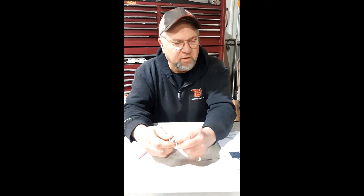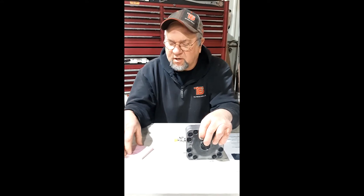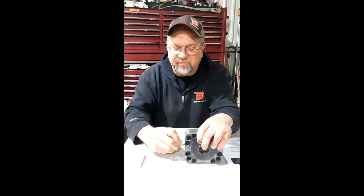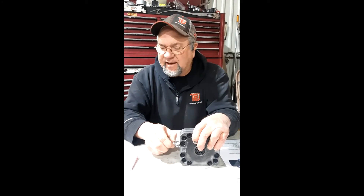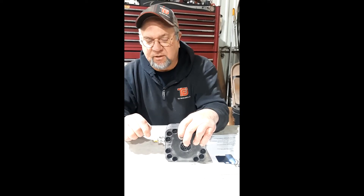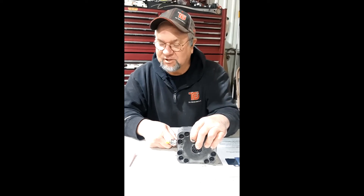When you put this thing into the accumulator, you torque this part into the accumulator with a torque wrench. The torque on that is 120 inch-pounds, or 10 foot-pounds. When you close this thin nut down — it's pretty thin, so don't get carried away or you'll strip it out — tighten it to 55 inch-pounds, or 4.583 foot-pounds, or 6.2137 newton meters. The cap gets torqued to 5 inch-pounds, or 0.416 foot-pounds, or 0.564 newton meters.